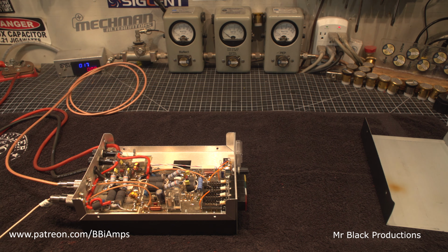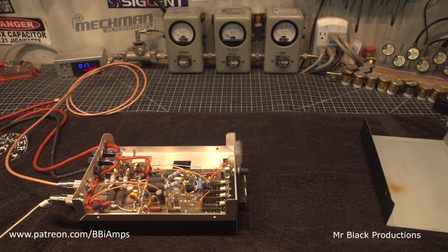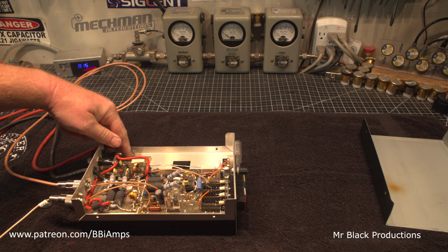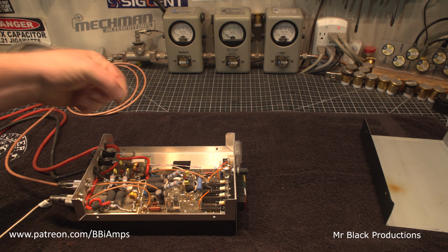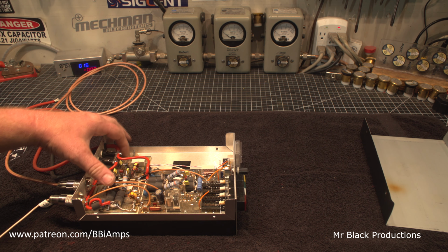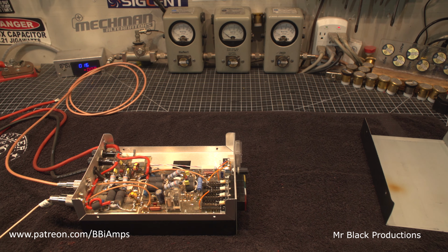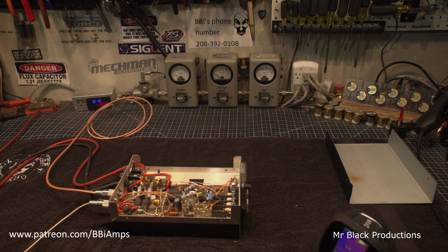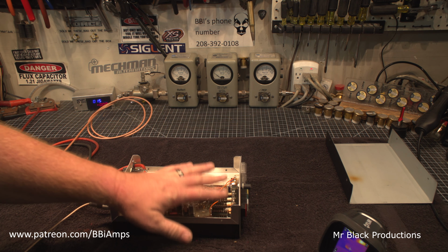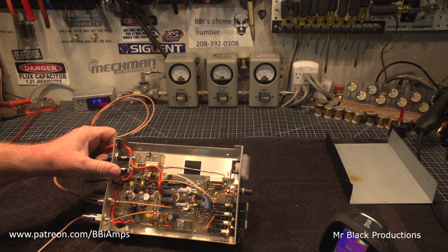So I would probably lean to myself that you've just had a general capacitance failure. It's no big deal. Give me a couple minutes. I will scrape all the exploded capacitor guts out of here, and I will wash this out with some rubbing alcohol to help neutralize the electrolytic schmoo that's now all over everything so we don't have corrosion 10 years from now. I'll replace that filter cap and I think we'll be done. Easy peasy. Add a new electrolytic to it, put a new light bulb in it. Light bulb's working.